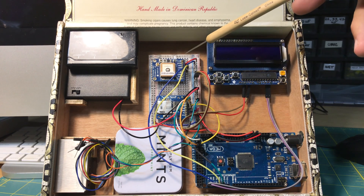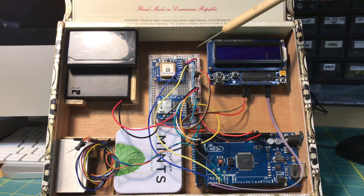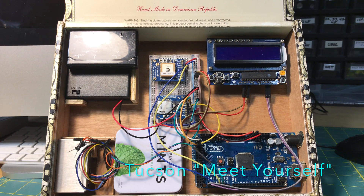Currently I don't have the GPS figured into the programming yet because I actually wanted to get this up to a point where I could take it to an event that's happening today to see if the PMS5003 sensor responds accordingly. But the bottom line is I will pretty soon have that GPS integrated and logging data to that SD card, and that opens up all kinds of interesting possibilities, like writing a file that I can automatically import into Google Earth as a KMZ and having it map my location with air quality data over the course of a day.